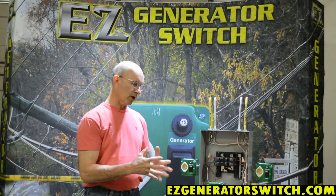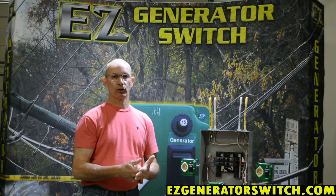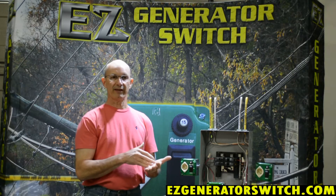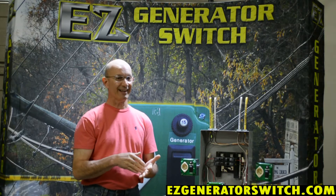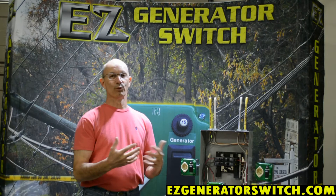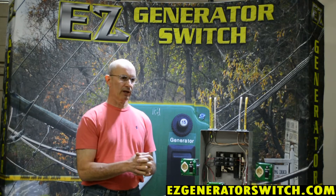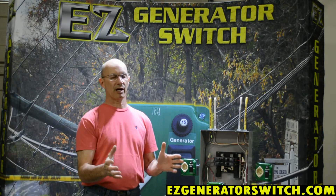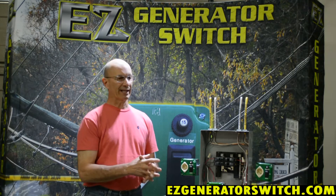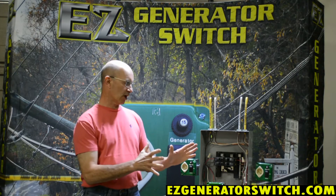The other issue we run into all the time is people asking whether they need to ground their generator. Yes, you need to ground the frame of your generator. We've actually had people tell me they were disconnecting something on their generator in their bare feet out on the grass and got a shock — not a good practice. I'm an electrician, I won't do it. We don't know what could possibly happen, so why take the chance? And there are other things with generators: no generator ever gets run inside, they're all run outside. They should be a distance away from the house — we recommend at least 10 feet. You need to check your local codes, but at least 10 feet with the exhaust facing away.